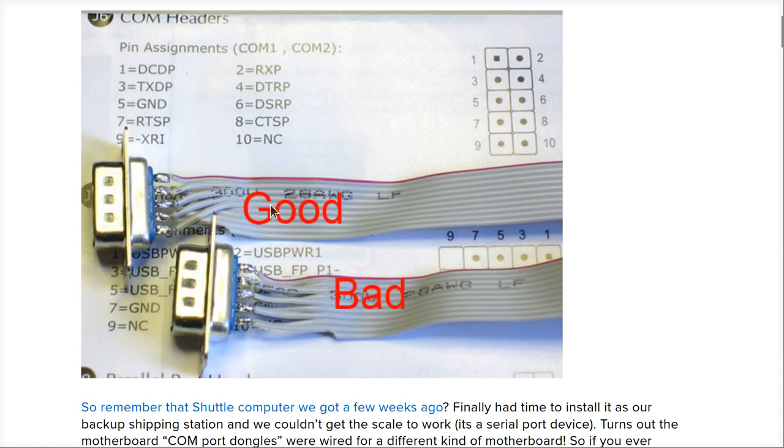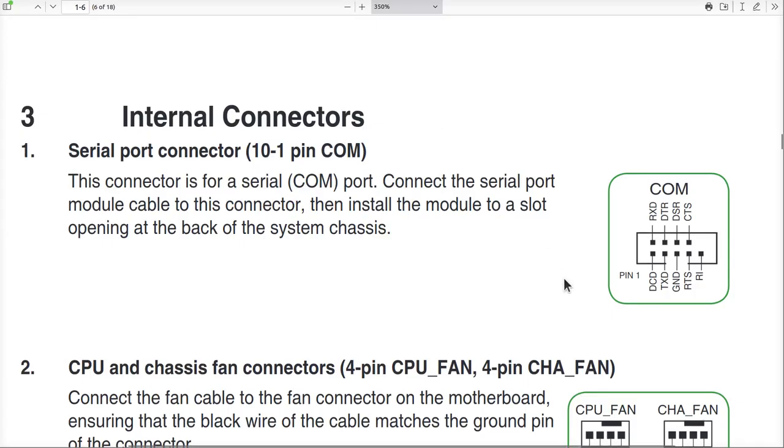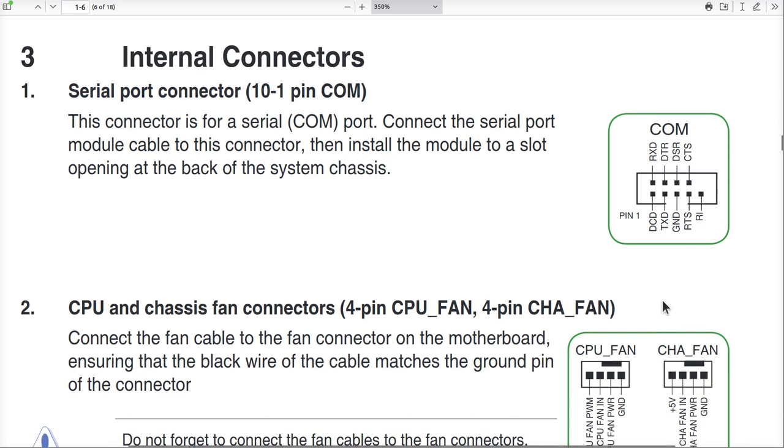But the reason Adafruit points this out and calls this one good is because motherboard manufacturers, whoever came up with this, decided that it would be a standard to maximize the cost of manufacturing those cables as well as the pollution and soldering fumes and everything else. Look how they number these things. Pin 1 is here. Data carrier detect. Pin 2 is receive data. 3 is transmit. 4 is DTR. 5 is ground. This is the top row